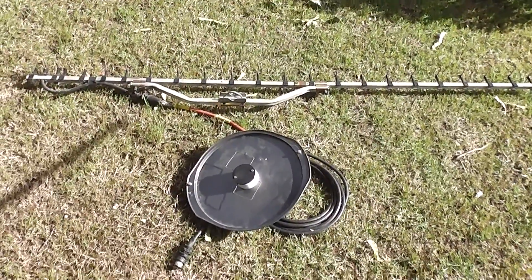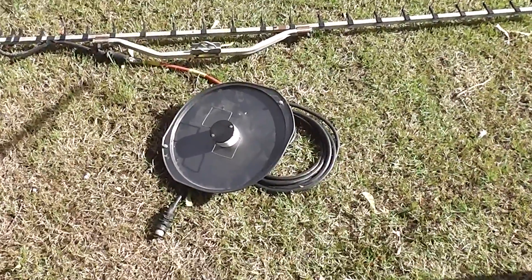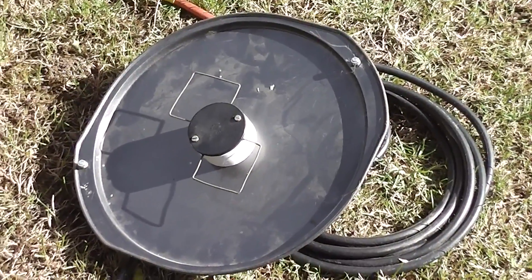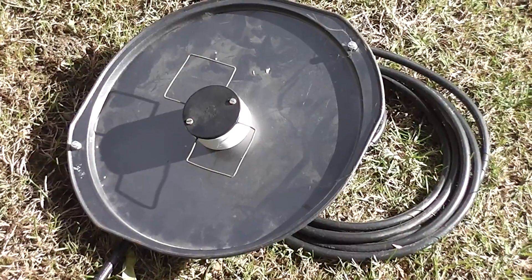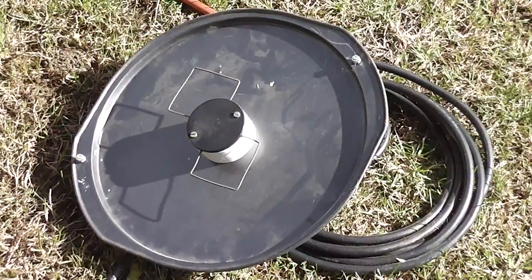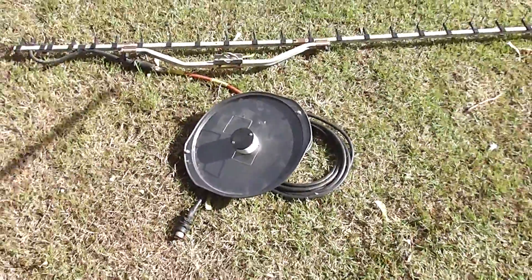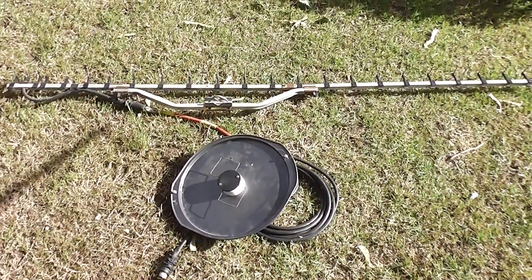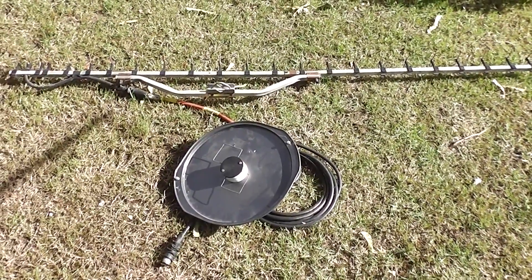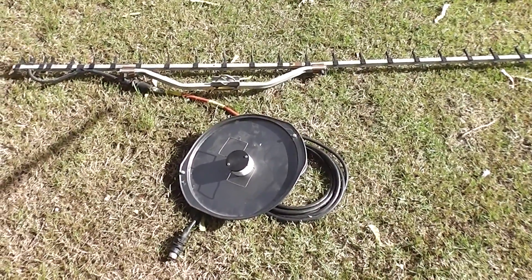Here are a couple of aerials for 23 centimetres. One at the top is a commercial aerial and this one at the bottom is something I made from a design on the internet — it's a bow tie. Horizontal polarization is the correct orientation as shown in this video. So you could get started quite cheaply if you're not too far from a transmitter and you don't need a lot of gain, especially if you made the aerial at the bottom. Sorry about the outside noises — thanks for watching and I hope you found this interesting.